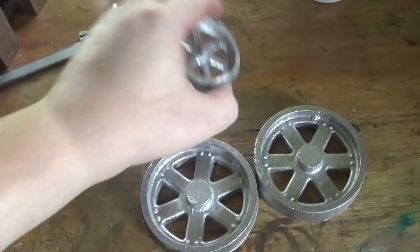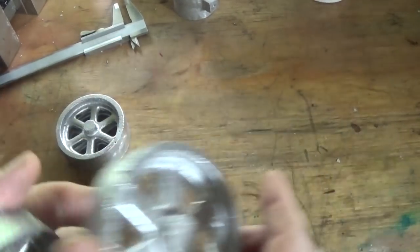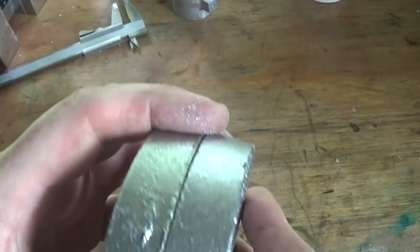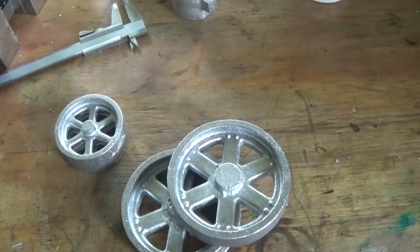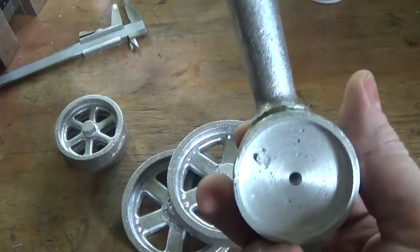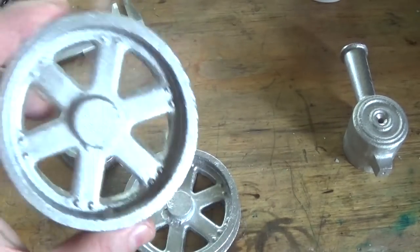These little wheels come out really nice because they've got some good taper on them. These ones need a bit of cleaning up — probably a little cold chisel, a rotary burr, or a little bit of work to clean out where it's moved. It doesn't have to be done just yet, but if you've got some patience to clean that up it's worthwhile. They're not very big, so you can build this on a small lathe without too many problems — that was kind of the idea. If you were to bolt it down on the cross slide and use some imagination you'd be able to machine that, but the rest could be built on a three or four inch lathe, no worries at all.